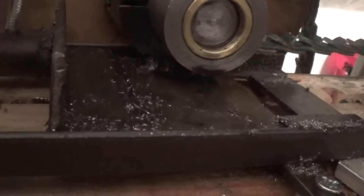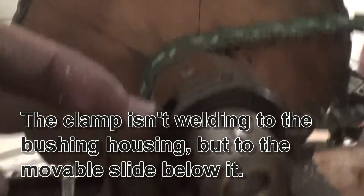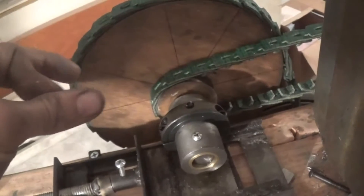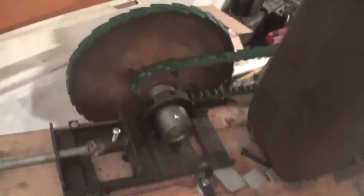On the housing I've welded the bottom half of a clamp. On the top there's a hole for oil — I kind of wish I did a better oiling system with little oilers that stick up. On the bottom there's a little hole where the oil goes through to touch the shaft. That's super important, though I wish I'd done a better job.